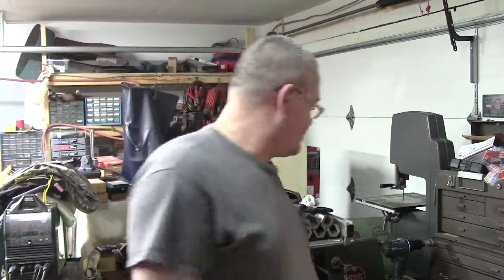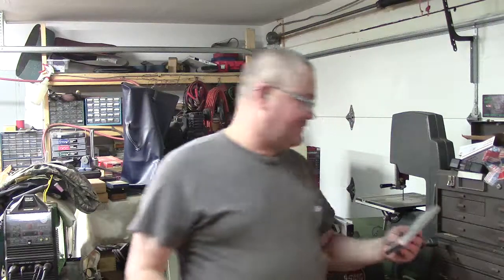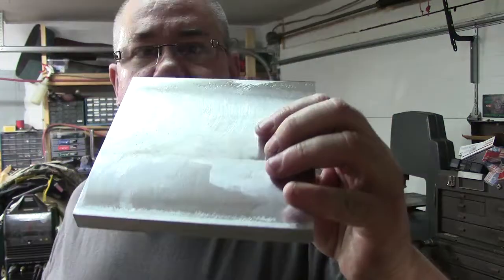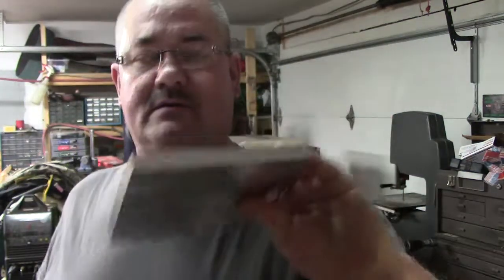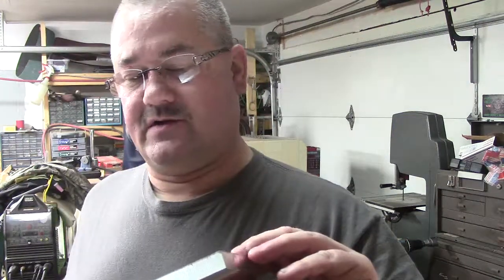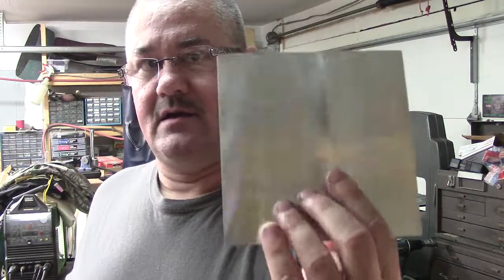So, same thing on the other one. I did two of them, tuned in the rate, dialed it in, and it just came out beautiful. It's like a mirror. And same thing again, you can barely feel that little transition point. And same thing here on this one. This one's even better. This is the one I just got through doing and really got the feed rate dialed in to where it was just smooth.